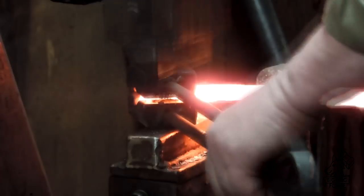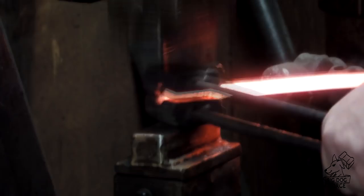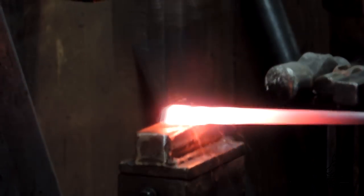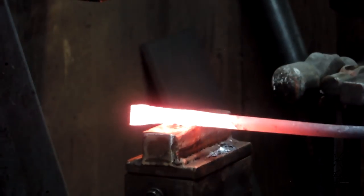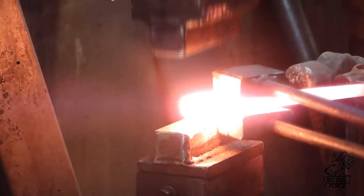This is pretty good wrought iron for being a fence. In a couple of areas I worked it a little bit cold — probably shouldn't have — but it didn't do too badly. I had one little tiny crack but I hit it with a torch, gave it a little weld, and it came out fine. This project really didn't take much time at all. A lot of the work was in reducing the material from three-quarters down to half inch round. If you start with half inch material it goes pretty quickly — this is only a couple hour project, even with reducing the wrought iron.